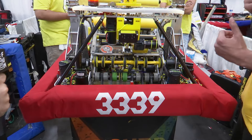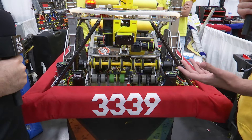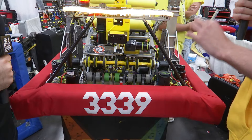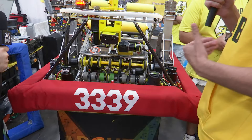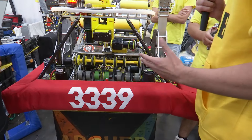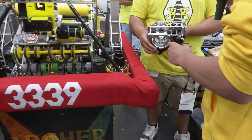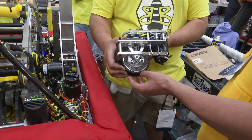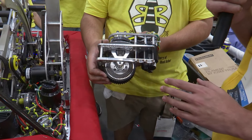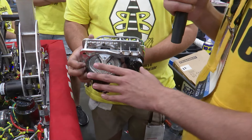After their second competition, to gain faster acceleration, they made their bevel gear bigger, which also required customizing their wheels. They ended up with a gear reduction of 5.55, a customized bevel gear, and a customized wheel — significantly larger than a standard SDS module.